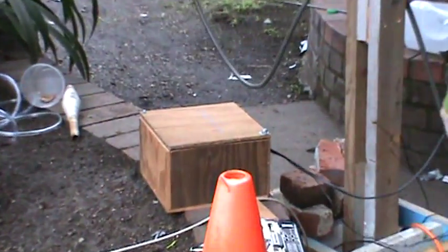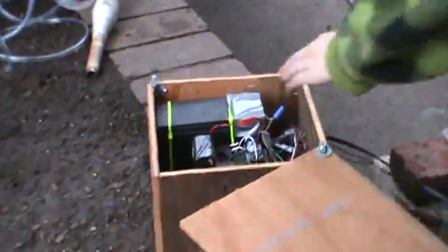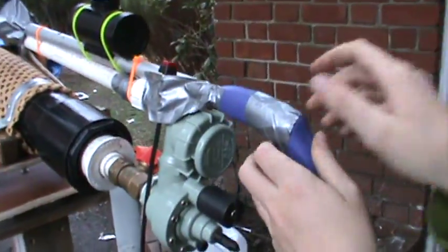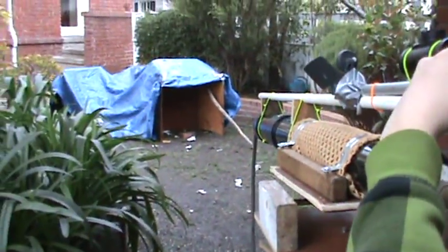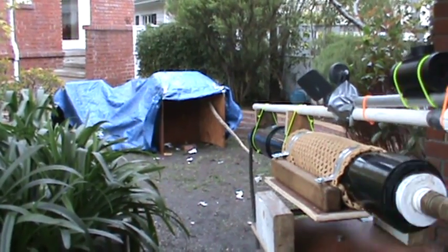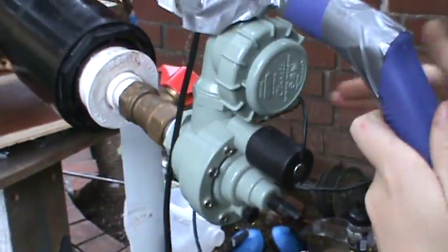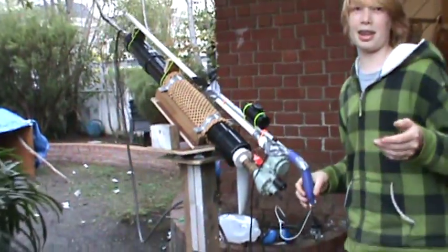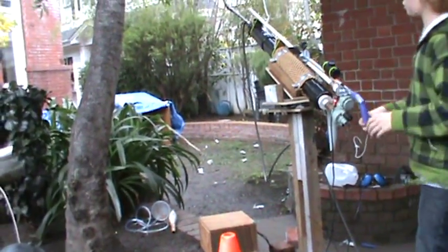There's a box, and inside this box is a battery pack and some other things that I'll show you later. They wire up to this button that's being bypassed, just acting like a wire because we pressed it down. This button will fire the gun if I press it. Watch: 3, 2, 1. That pressed it and allowed power to go through the system to the solenoid valve, which opened up and let the air from this into the barrel and shoot whatever was in there out. There wasn't anything in there right now because we're just doing a little tutorial showing you how it works.